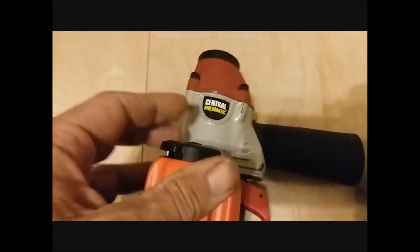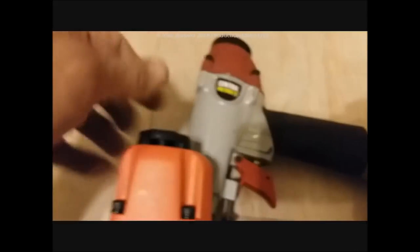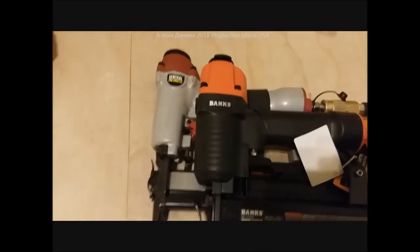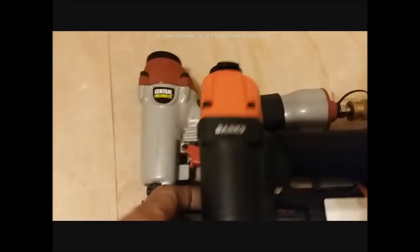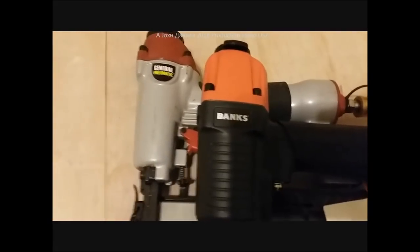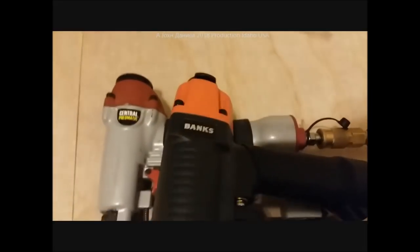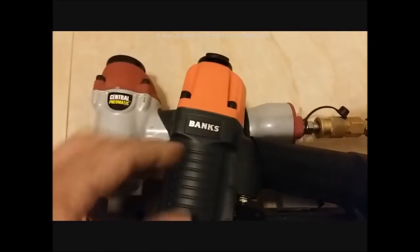The difference between the two is quite obvious - the piston. Both have directional air but this old one is pretty simple. The new one actually looks like it'll float downward and not as much on you, so that's pretty good - you can get oil on your hands otherwise. Obviously it's a larger piston between the two. I don't think they're going to waste material just to do that, so this old one here being a 2cm piston, the new one is supposed to be 2.68cm. That's significant when you think about being able to use even lower pressure to get the same results, though it might require more volume.